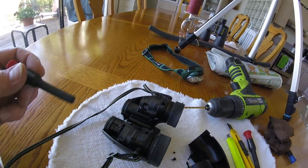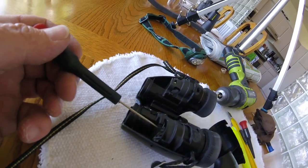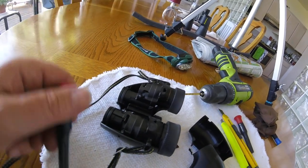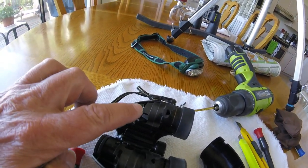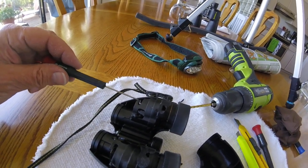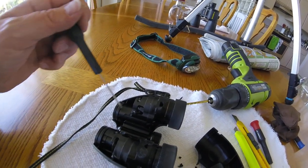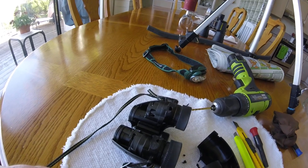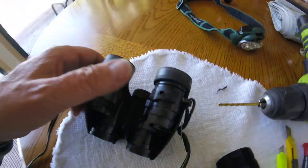What I found out was that by moving this — there's a little spring clip right here, it's not anchored to anything — I just pried it a little bit to the outside, moving it this way. And the same thing on this one. You can see they're not all the way seated. If it was all the way towards me, this edge would be touching here. I just kept moving those to the outside and looking through them until I got a single image in the binocular field of view.